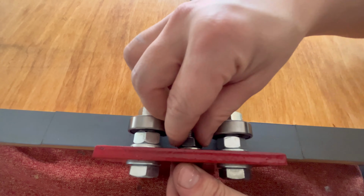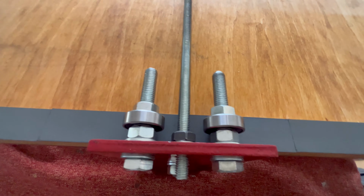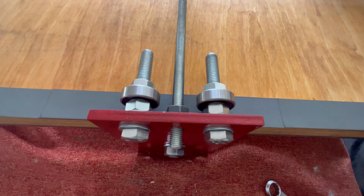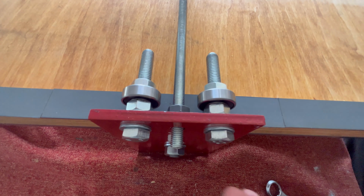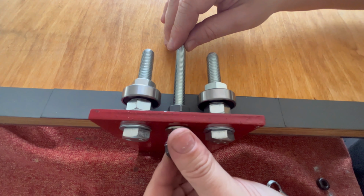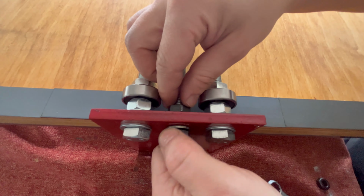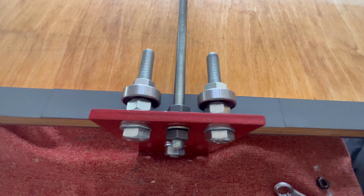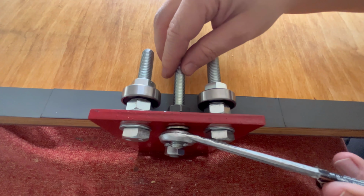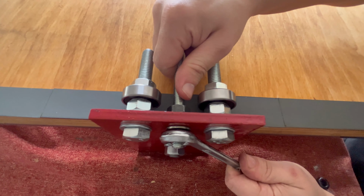I've added some rubber on top of the steel rail, as my drilling plan was a little bit off and I had too much space between bearings holes and the roller. It resulted in some movement which may not be that bad, but I didn't want to have it in the first place. The rubber I used was from an offset printing factory I was working in years ago. But you can use more widely available material like isolation duct tape.